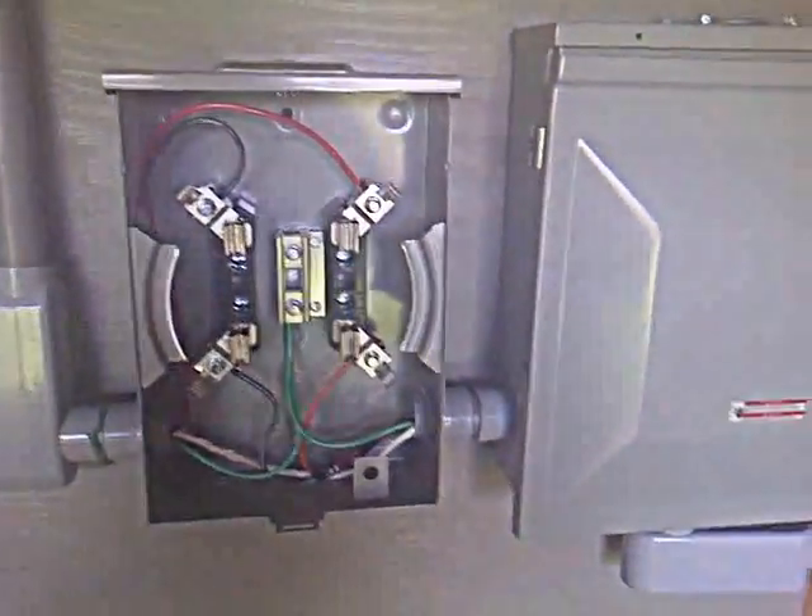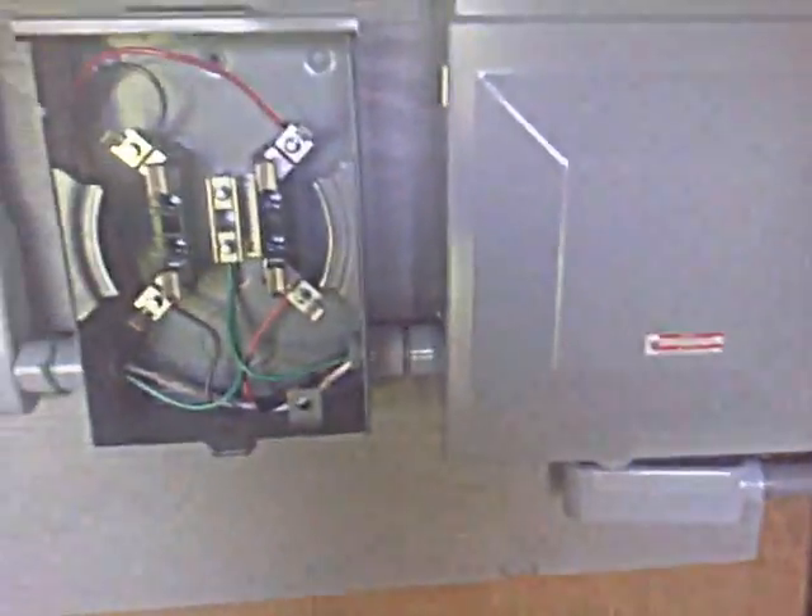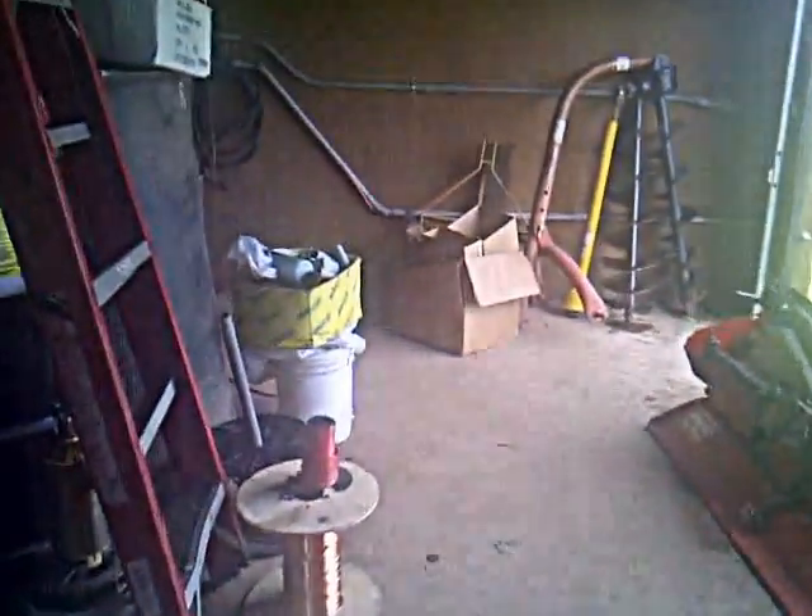Basically, that's the system. It's a nice system we're doing here in Douglasville, PA. I can't wait to put the panels up — that'll come Monday. Here's all the panels here. As you can see, they're Canadian Solar. Great, awesome panels. I love them. They have a 25-year warranty. There's all the info on the back. Basically they're a 230-watt panel, 29.6 VMP, and the VOC is 36.8. Great panels — built real well. I'm real happy when I use them on a lot of my customers' installs.